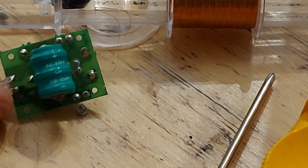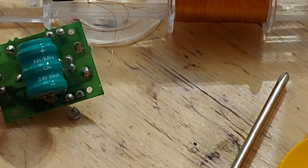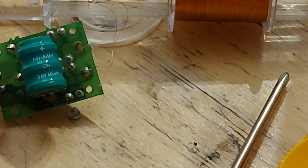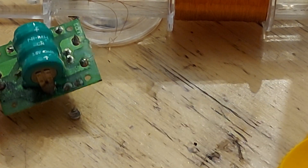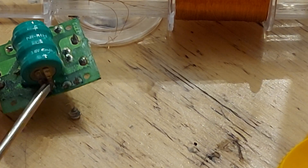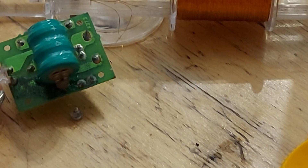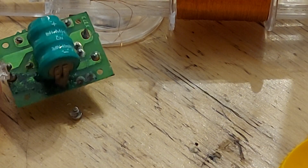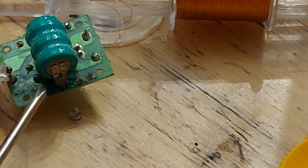Can we actually read what's said on that battery? Nickel metal hydride, 3.6 volts, 440 milliamp hour. I should think it's just three cells stuck together at 1.2 volts each. I could put a bit of wire from the back of the diodes there directly to the battery terminal. That is what it is though — the battery's leaked and etched the copper track out of existence.